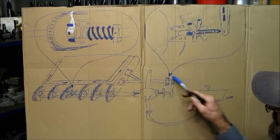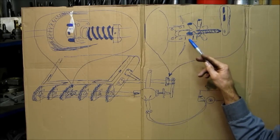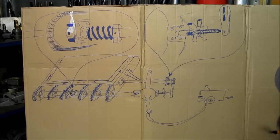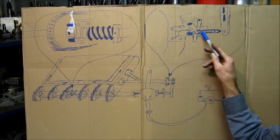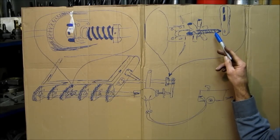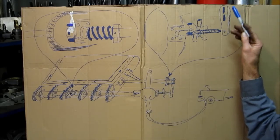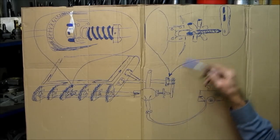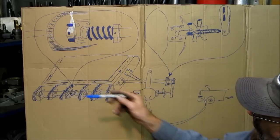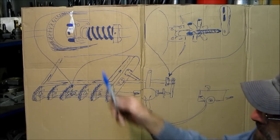This unit right here is called an old man — shown here in enlargement. This is bolted to the back of the air motor, which was roughly about five horsepower. On the inside of the star drive was a point — a 60-degree center, just like a live center on a lathe. The bar had two slots on this end, mounted with bolts to your rigid section, and a center drill at the butt end. You were able to push the motor and bar all in one direction, and what kept it from just going that direction was mounting a spring and a collar against one of your bearings.